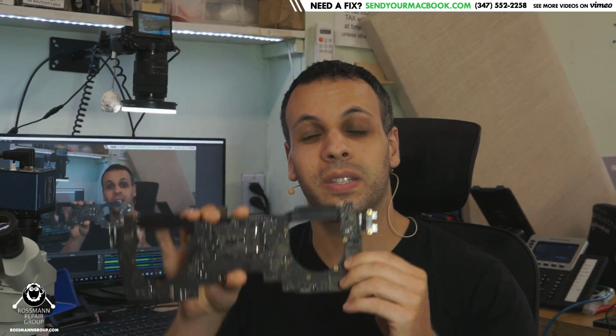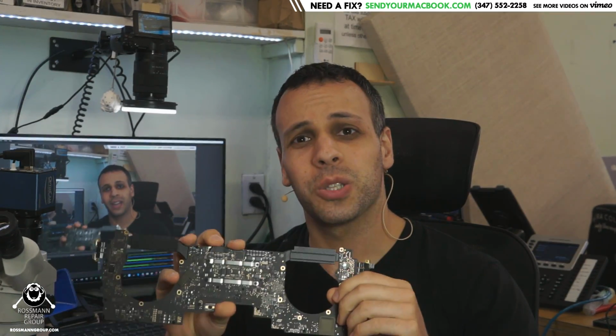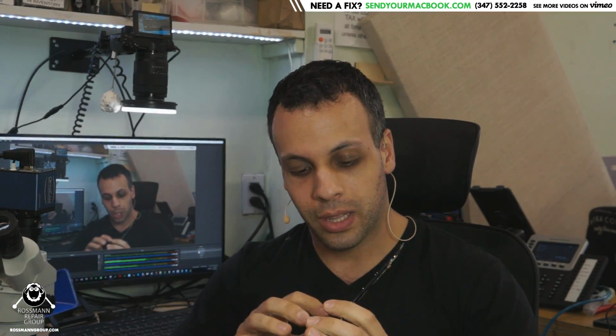When I call this person, I have to tell them that not only is their only option to fix it the company that's going to charge them virtually the same price as a new one, I also have to tell them that their data is completely inaccessible. Unlike the other machines that have a lifeboat connector here so that if the board dies, you can at least get data off of the soldered on for no reason SSD, this one does not have that. So if I'm not able to fix the board, their data is gone. Anything that's not been backed up since the last backup is totally gone.